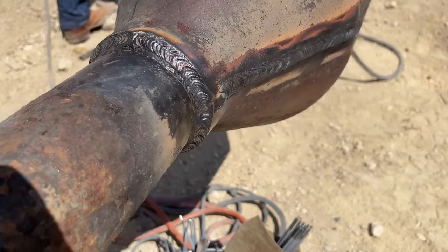On this initial strike up, it doesn't show it on this. We didn't get it on camera. But I will strike up on it just to make sure there's nothing residual left. Because sometimes it will blow out and it sounds like a little jet turbine taking off, with the gas escaping out of the encapsulation. But I just do kind of a plug weld and then a few stringers, and she's sealed. All right, guys, hope that was interesting. This is basically how to weld up an active leak on a residential gas line.